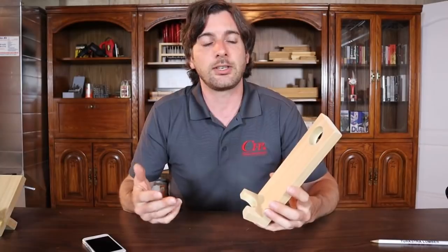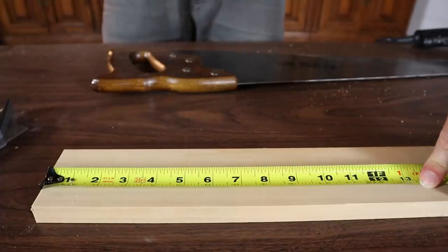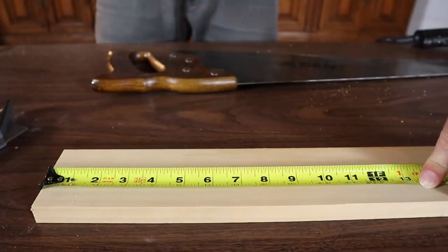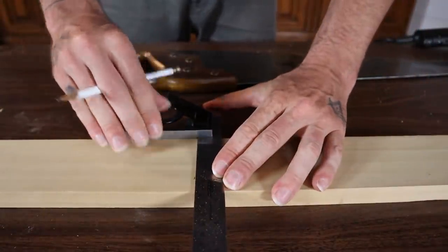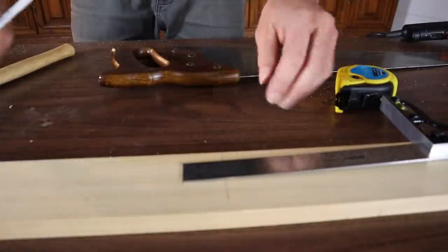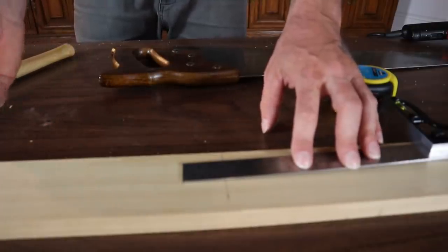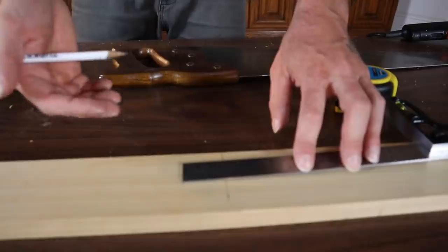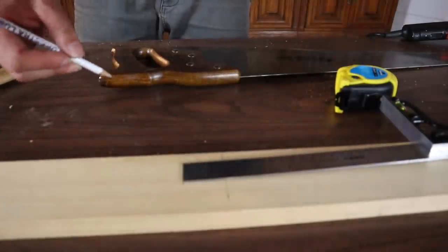The next one is a really neat phone charging station. It hangs on the plug on the wall and then you can put your phone on it — great for beside a bed or anywhere like that. For this hanging phone charger holder, the first thing is your layout: mark it at ten inches and draw your line across. The hole at the top that hangs on the plug will depend on the size of the plug you're using; I'm using an inch and five-eighths Forstner bit, and I'll mark mine an inch and a half down from the top.